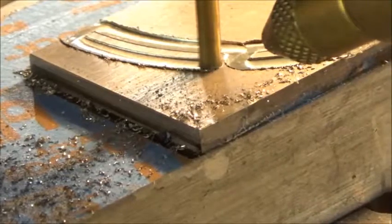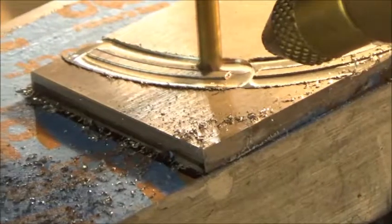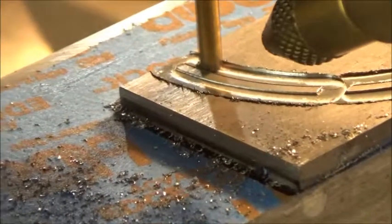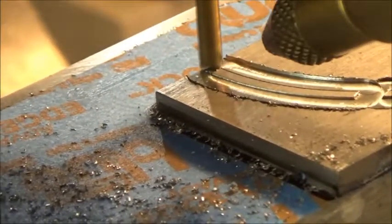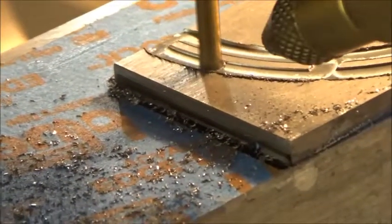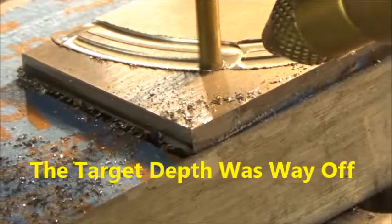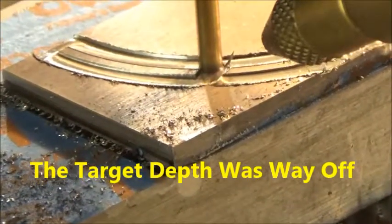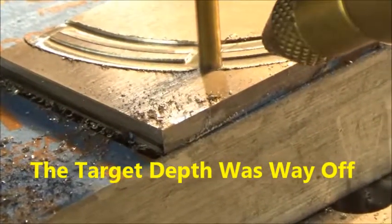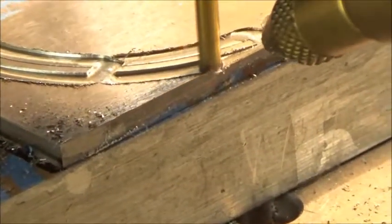Look at that — the back's cutting. So the painter's tape and the super glue are still bulletproof in my estimation. I don't see a problem. I thought last time that maybe we had a problem with that, but it's not that — it was the end mill that was moving. And I should have realized it right away, because the difference in the depth of cut from one side to the other was a lot — about 30 thousandths of an inch in reality when you measured it with a caliper. That was not a good situation, and there's only one thing that could have caused that: the end mill moving.